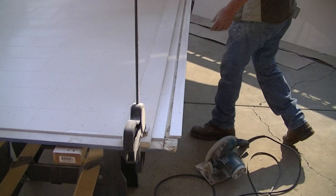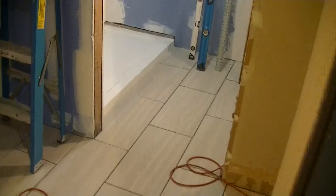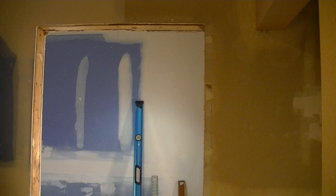One challenge many are going to run into is running the panel through a doorway. We measured diagonally and it's seven foot two diagonal. These panels are 93 inches tall — that panel is not getting through here, and we only got four feet so we're never going to get it in. What we've been instructed to do by the owner is to cut them shorter and then piece them back together. Short of taking out this header, that's what needs to get done.